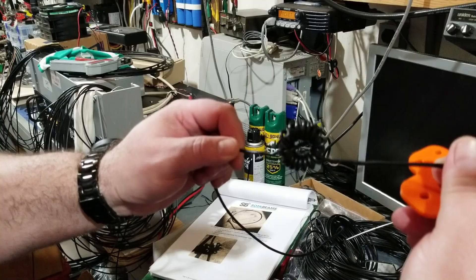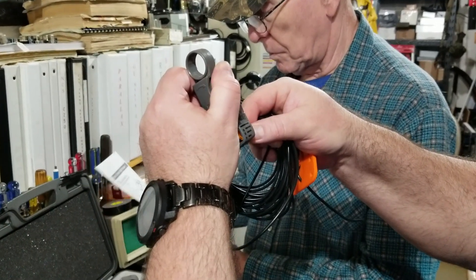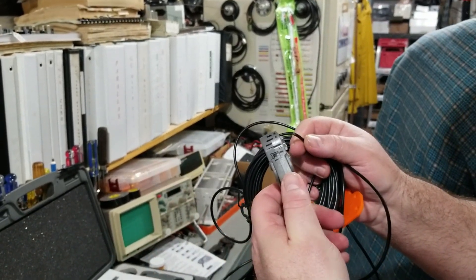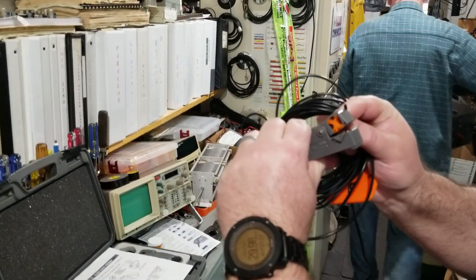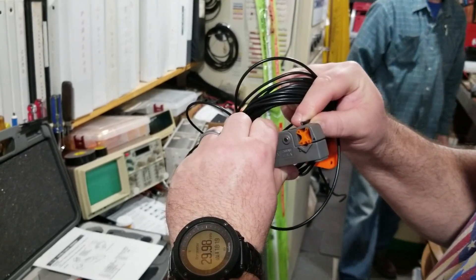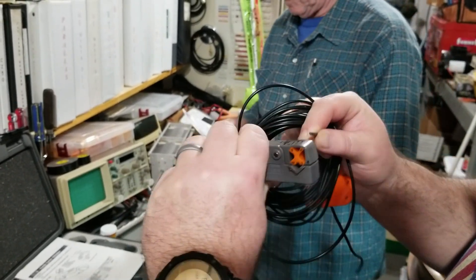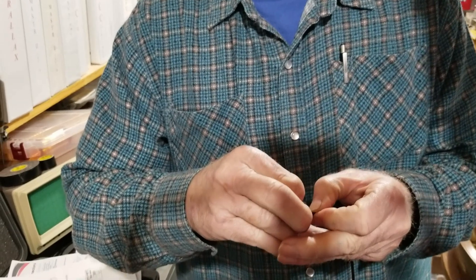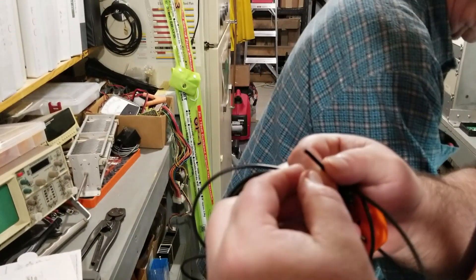We're going in eight millimeters. What we're doing here is cutting the RG174 to get the jacket off. You do this in two stages. This little cutter — we put it in about eight millimeters and try that twist move. That's what KY4CKP did, and it should just go to the depth we need to remove the jacket. These cutters and crimpers are from AC4DM's library. The outer sleeve or outer jacket has now been removed.